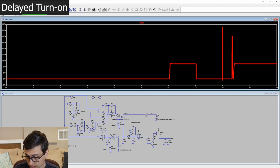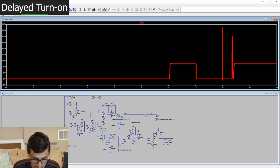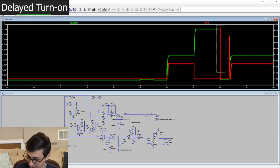That's behaving exactly how we would expect it to. Then, of course, the regulator, the input voltage turns off at 7 seconds, like it should. We can see the output of our compensator go from its steady state value, where we're regulating to 10 amps, up to the maximum for the system. Yep, we're just hanging out at 9 volts. Then the 200 volt source comes back.